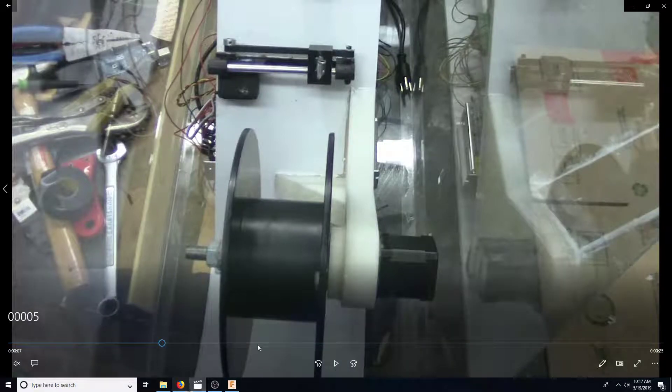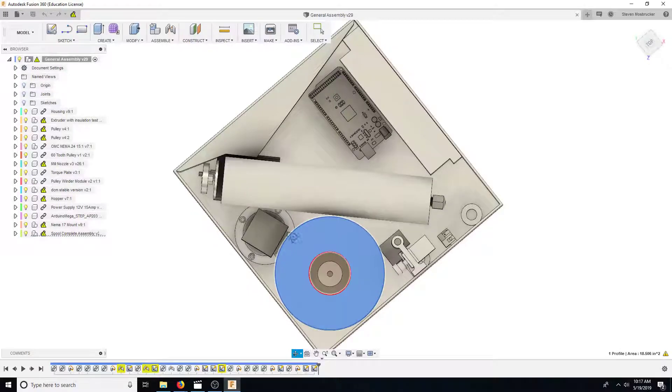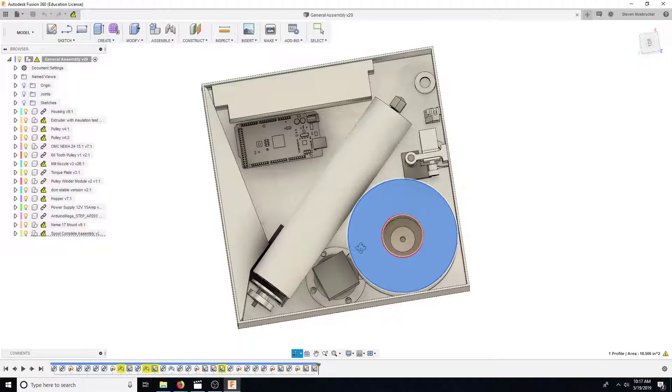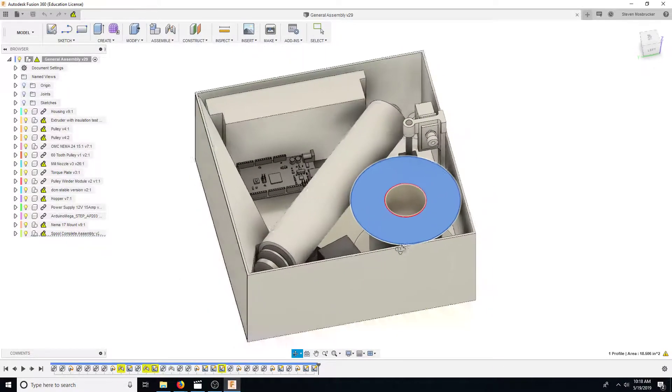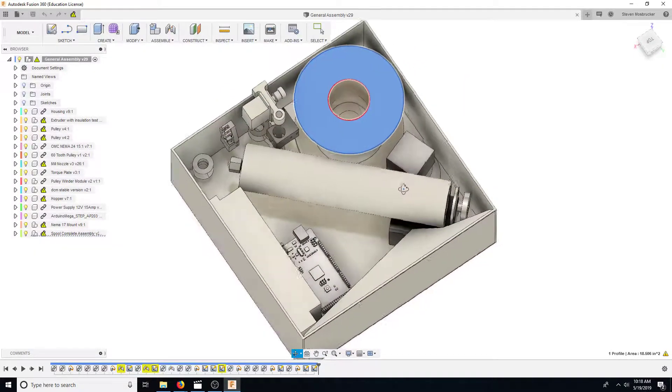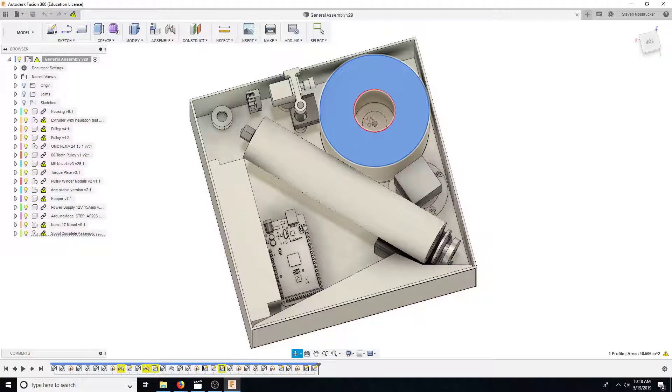There are going to be teeth on the spool and teeth on this gear here, and the teeth on both are going to move this spool. The reason is that we want to maximize the height of this spool so it clears this box. My original design used drive cones like the Multi-Stirer, but the drive cones lifted the spool up so much that I had to cut the diameter so small that the inner pin diameter was only about one inch.